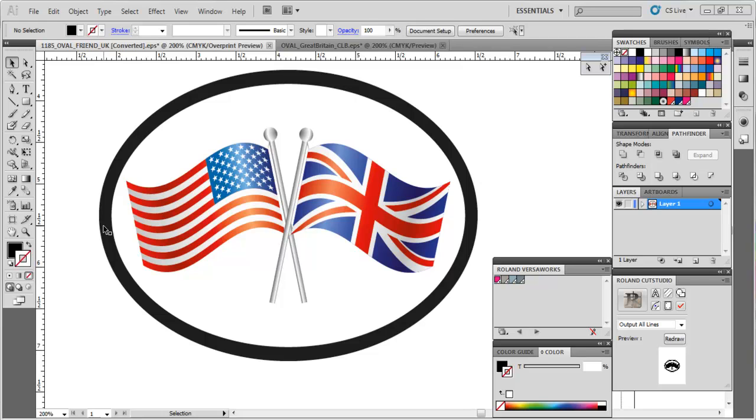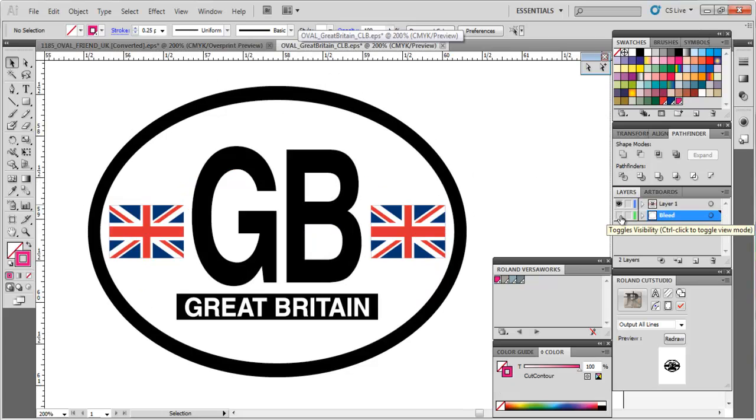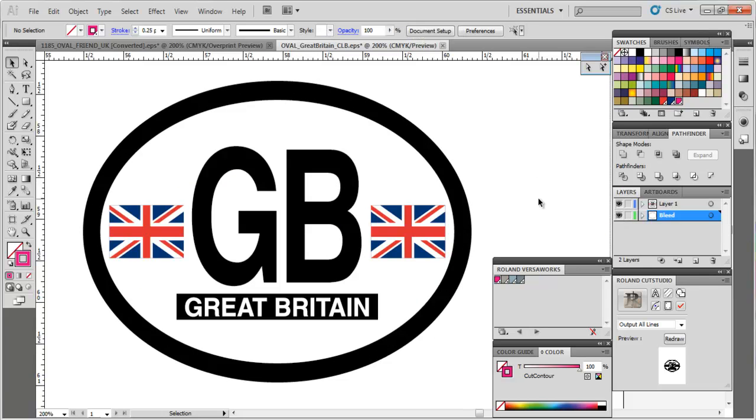Oval shapes are one of the hardest shapes for any printer cutter or straight cutter to run, simply because it's moving in all of its axes at the same time. So it's easy for these to get slightly off. One trick is to add more bleed, and on the second example you can see there's a bleed zone set up. But even with the bleed and the black on the edge, you're getting heavy ink saturation, so the medium might tend to curl a little bit, making it harder to work with for the end user.